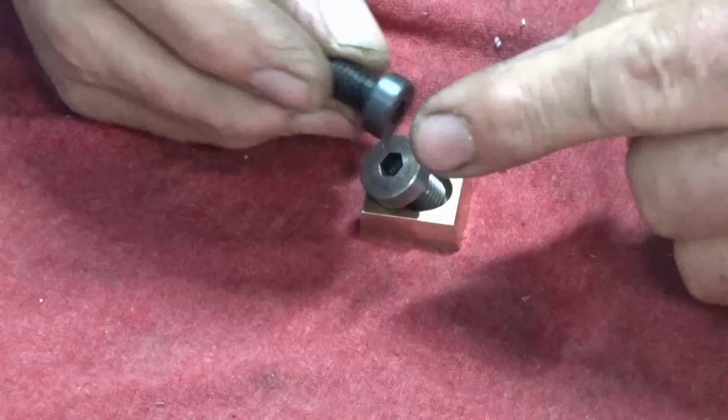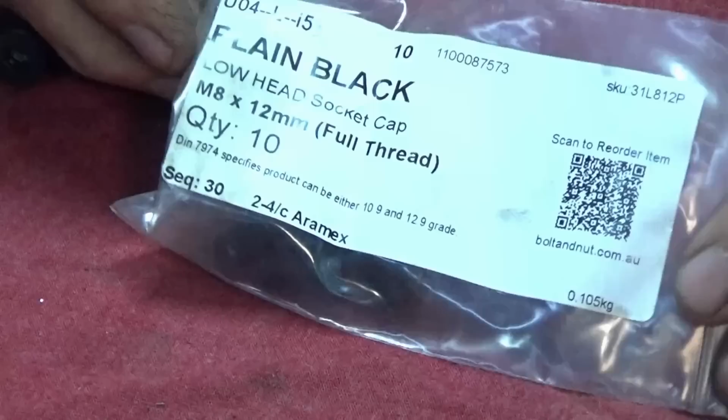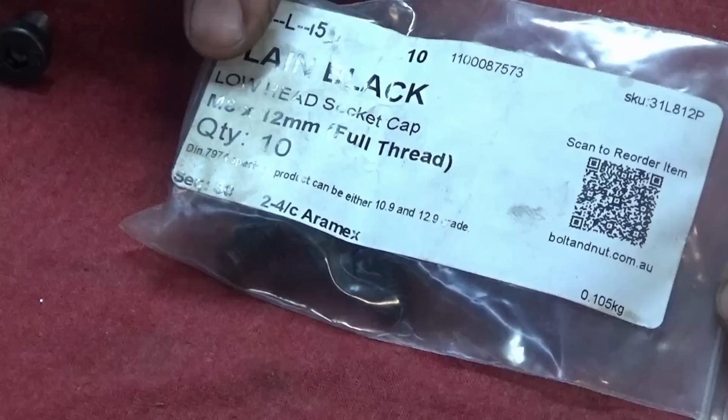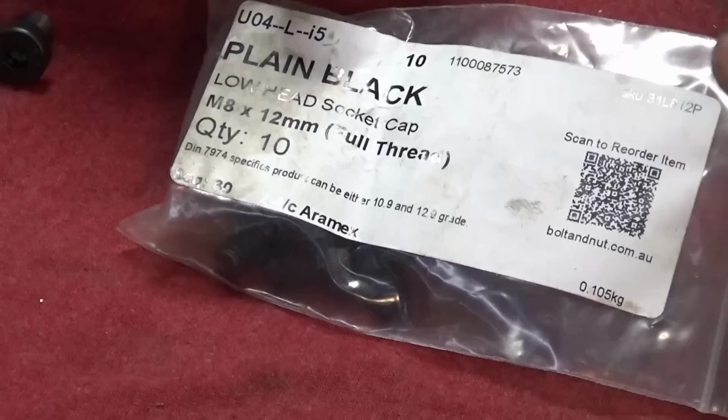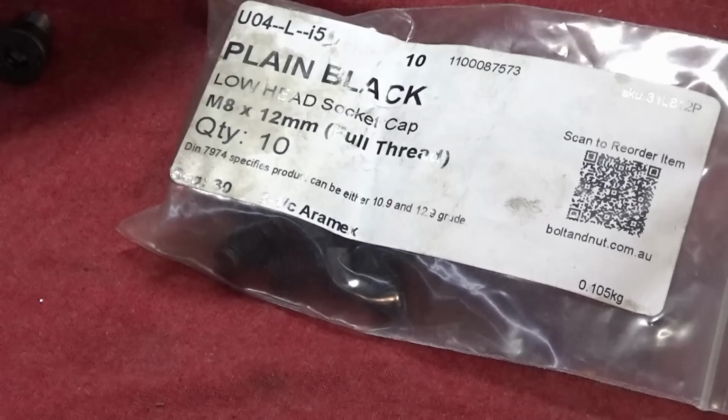Now, I bought a set of what's called low head M8 socket head screws. So here's the packet. So you can see there it says low head M8 by 12. If you're dealing with imperial dimensions, that's close enough to 5/16 of an inch. Now, I got these from a company here in Australia called Bolt & Nut Australia. They're not a sponsor, but I'm really happy with their service. They can supply just about any fastener very, very quickly.